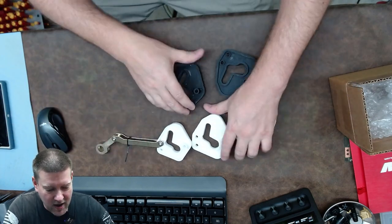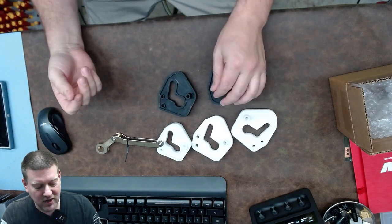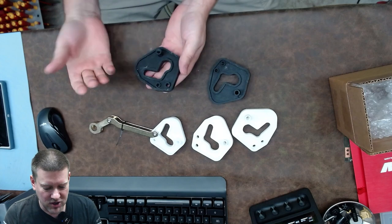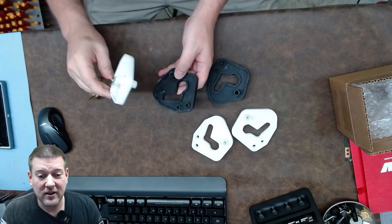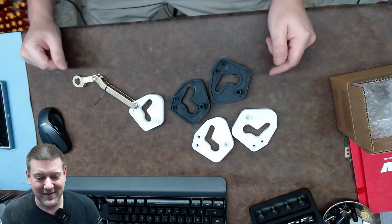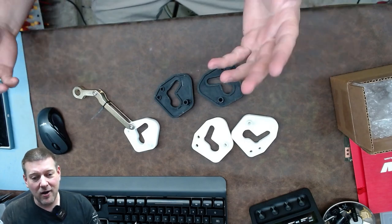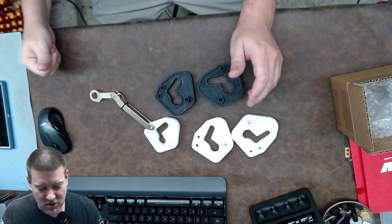That is my community project. I'm going to leave the finished model in the video description eventually. I'm going to do some more measurements and check the 3D model to make sure it's a one-to-one ratio. If it is, then the 3D print was off by 5% — a calibration error. But I don't think it's the 3D printer since all the holes are spot on for spec. I think the 3D model was just scaled a little too big. I'll post the download address in the description so you can rebuild the Stryker stretcher cam parts.